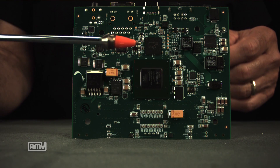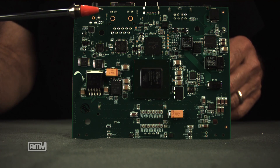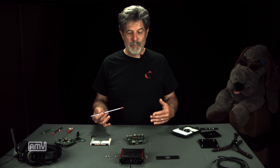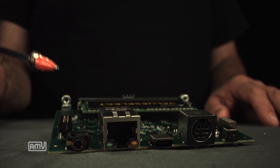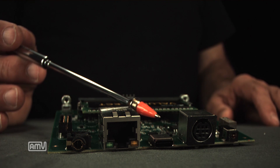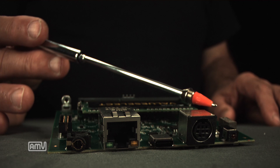We also have a Cypress FX3 which drives the I/O functions over USB 3, and we're using a Marvell chip to control the GigE I/O. On the back side of the board we've tried to think of as many ways to connect the outside world to the camera as possible — auxiliary power, auxiliary I/O port, USB, GigE, and a 3.5 millimeter 4-pole audio jack. We've added auxiliary power because there may not be enough power from USB or over GigE for your projects, so we've given you a 5-volt, 3-amp auxiliary input.